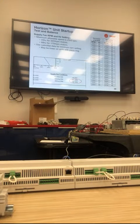So going back to the submittal page itself, on the supply fan, we put an operating RPM and a minimum RPM. The operating RPM corresponds to what we set as the max hertz. We offer 2 types of motors: motors that have a nameplate of 1745 RPM, and the other at 3450 RPM. If my operating RPM says 2045 and my nameplate's 1750, your max hertz should be around 68. And then the min will be around 36 to 38 hertz.